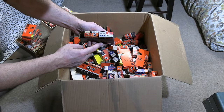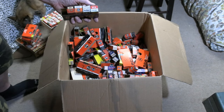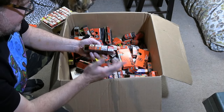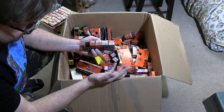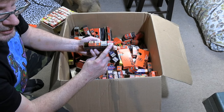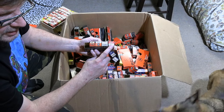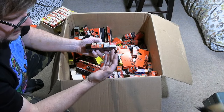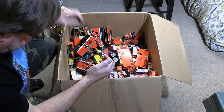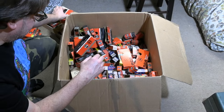Now and then you'll find tubes that just have four digits on them. Two possibilities: one, they're industrial or ruggedized tubes, or they are otherwise higher quality audiophile-type tubes. Generally these could just be a 6AU6 or 6AL5, but built for extended operation - like if they're going to be on a repeater at the top of a tower. They're more ruggedly built, more precisely made to last a lot longer. I think the really primo audiophile ones start with sevens typically.